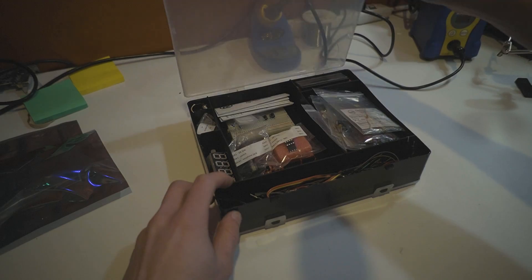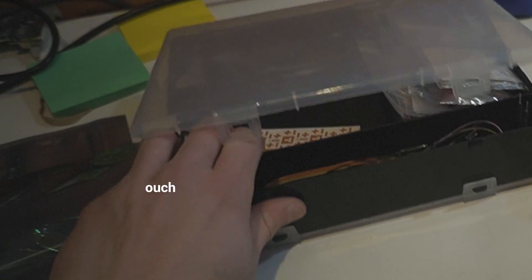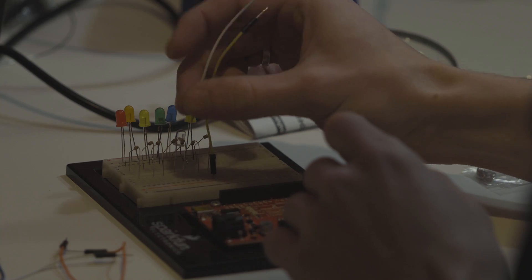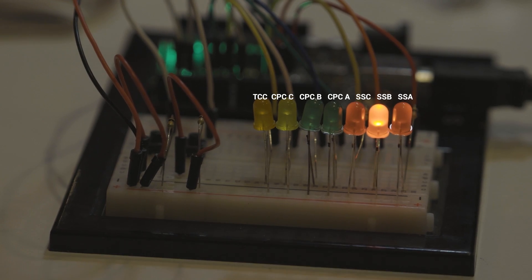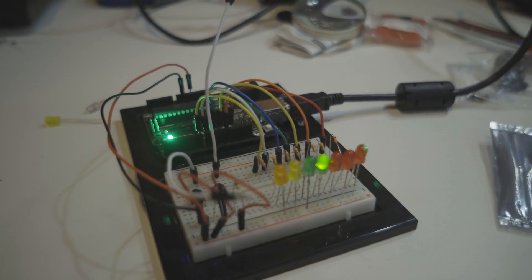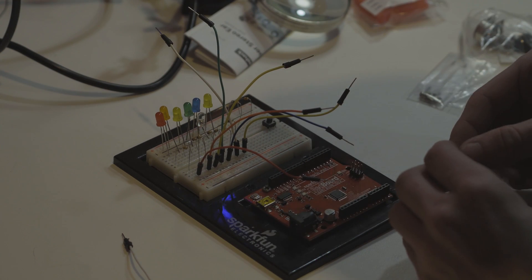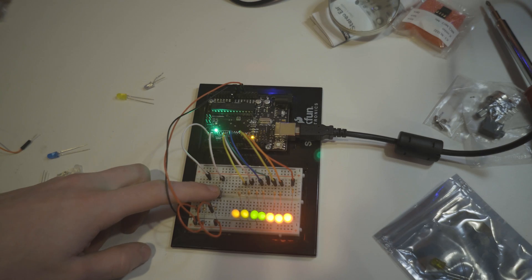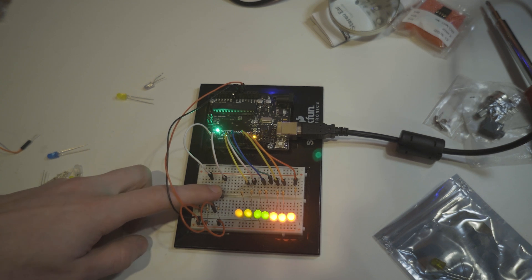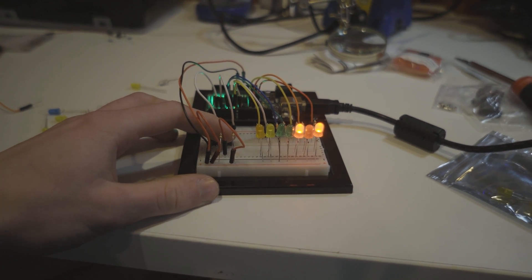For this project I decided to go with an Arduino Uno, at least to get started with testing. If you're familiar with these, you'll know that they only output 5 volts, and a little bit later I'll tell you how I'm working around that. I went ahead and hooked up 7 LEDs to the controller — one for each solenoid — to give me a visual representation to cross-check with my logic table. After verifying the LEDs were working, I added a pair of buttons: one to upshift, one to downshift. I hit a roadblock because a digital write command wasn't working as expected, and I had to learn what multi-dimensional arrays were — they sound cool, but they're really just a fancy name for tables. This fixed everything, and I was able to change between gears exactly as the logic table showed.